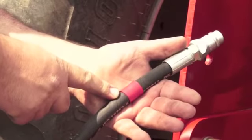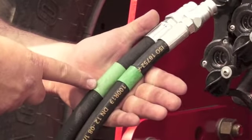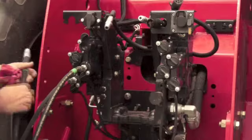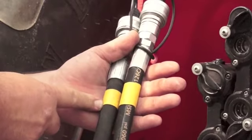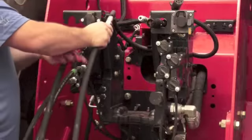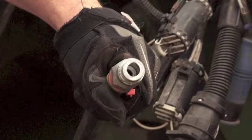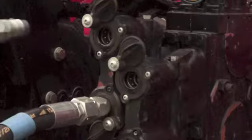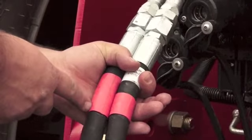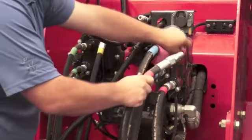Plug in the single red banded hose into circuit number one of your tractor. Plug the two green banded hoses into circuit number two. Note that the narrow band is always pressure in and the wide band is pressure out. Plug the two yellow banded return lines into one of the circuits plumbed to the tractor reservoir. You will notice there is no ball within the coupler to ensure it is unrestricted. Plug the two blue banded three-quarter inch hoses controlling fan number one into circuit number three. If you have a second fan, plug the two red banded three-quarter inch hoses controlling fan number two into circuit number four.